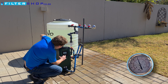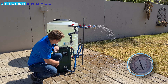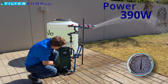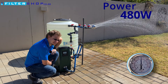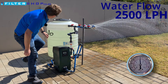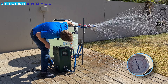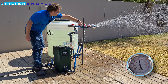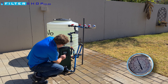If we then set it to three bar — staying incredibly quiet — with just a small flow it's 340 watts. A single shower is 390 watts. Two showers at 480 watts. Three showers only at 610 watts. And if we take it up to 2500 liters per hour, we're only drawing 740 watts. So at three bar it's easily manageable still.